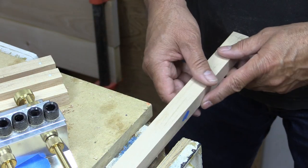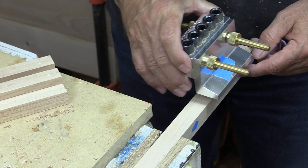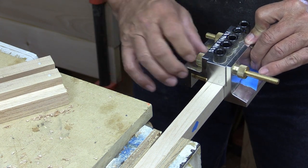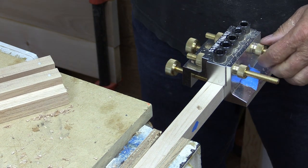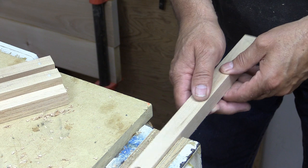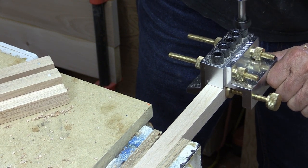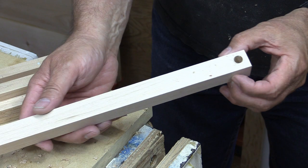There's the face side with the blue, and I put it in like that with this face side down. I have the blue marked on my doweling jig as well, and if you notice you'll see that I've marked an X where the dowels need to go. So as long as this is always matching the blue, I'm going to get all of my dowels lining up properly. Now the face side is on that side, and I'll just go on and do all the rest of them and then I'll do the connecting pieces.